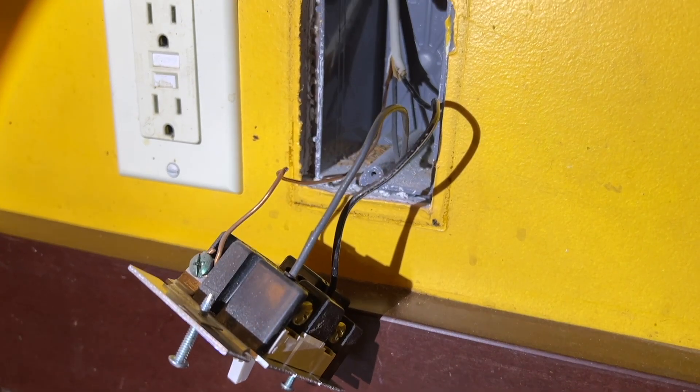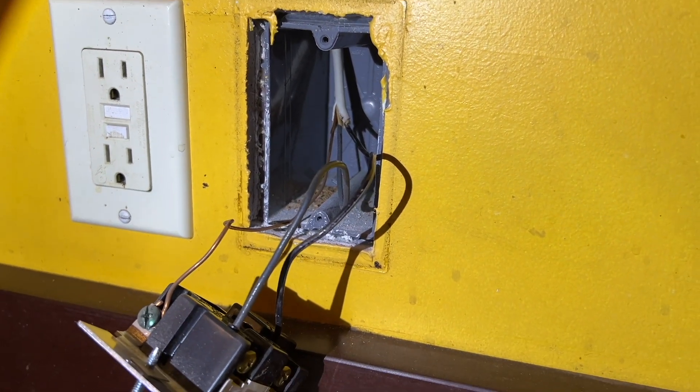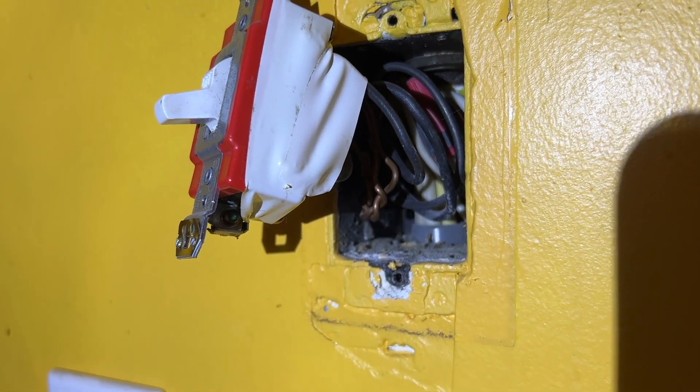So I started looking around my house for where I could install this, and I came across a couple of switches that weren't going to work. There are two big reasons. The first one is you need a neutral wire inside that box, and that is not always present. Before you install something like this — and this applies to all smart switches — you're going to have to open that box and see if the white wire is in there. If it's not, you'll have to run a white wire, which is a lot more difficult. The second problem was there were just so many wires inside relatively small electrical boxes that I really couldn't fit this in.